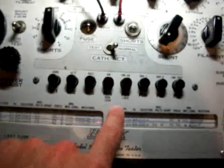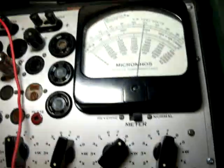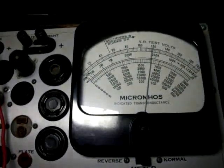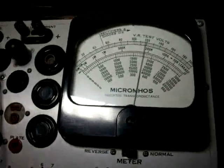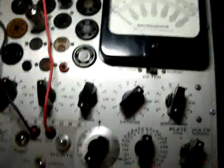So now we've pressed 4. You've got a lock and an unlock — you can press unlock first and watch what happens, and see where your needle goes to make sure everything's okay. Now go ahead and hit the lock. What you want to do is let this tester sit there and cook a little while, so to speak. Usually what happens as the tube is heating, it's going to go up a little further, then maybe start dropping down. After about a minute or two, if you really want to get a good test on tubes, wherever that needle stops is what your reading is going to be. Now we're going to take that out by hitting the 4 unlock and letting your needle go back down. Now we're going to test the other setting.